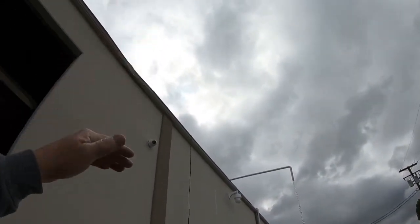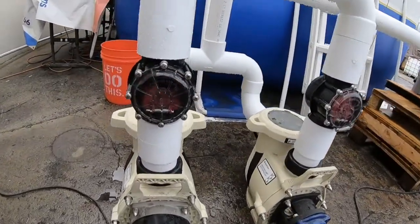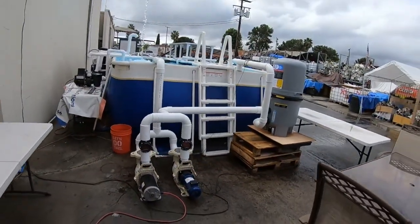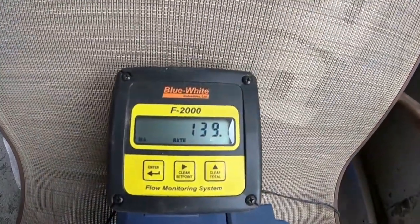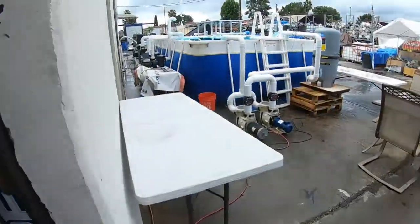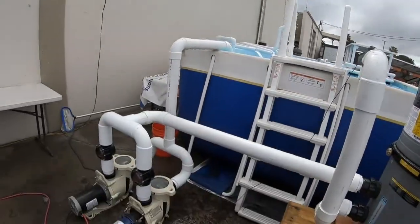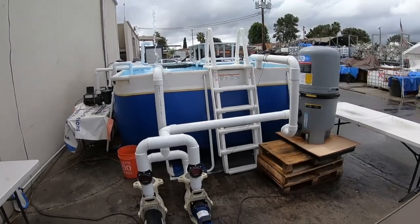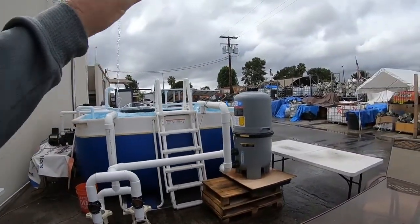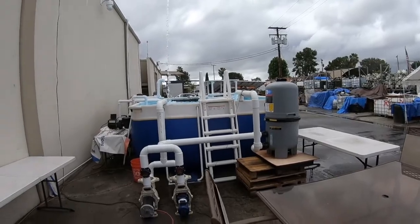With a rainy day and cloudy skies with clouds just moving through, the AC is still on but barely doing what it needs to do — barely pumping. The check valves give you a visual of what we're achieving. We're at 139 to 140, which will go back down to try to get that 135 sweet spot. On a rainy day you're still going to save close to 80% at this particular moment. When it comes to evening time, the AC pump takes over and the solar pump winds down around 5, 6, 7 o'clock at night. In the morning the solar pump ramps back up, giving you 100% savings throughout that entire day.